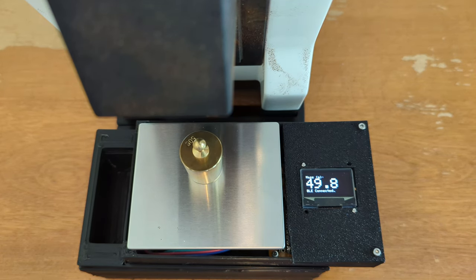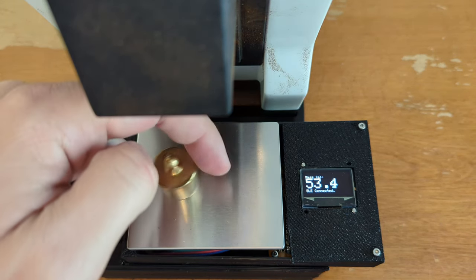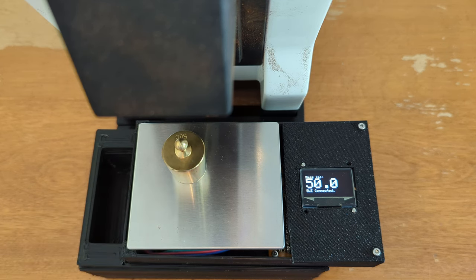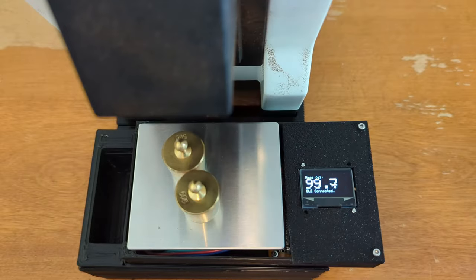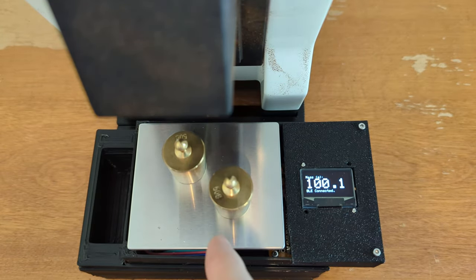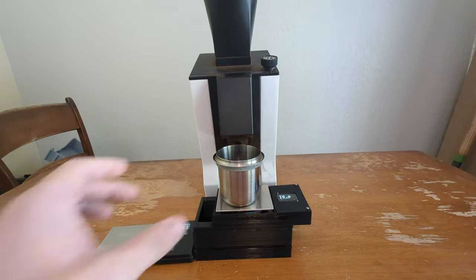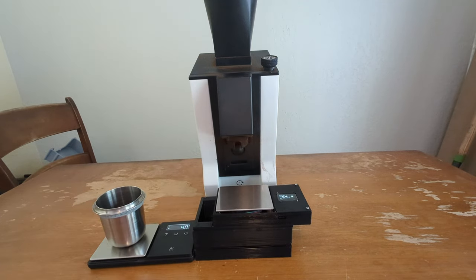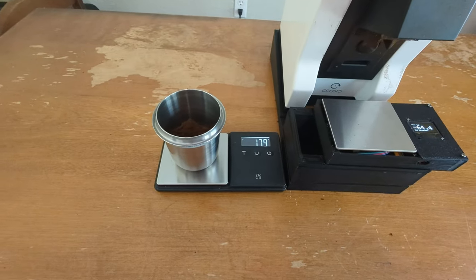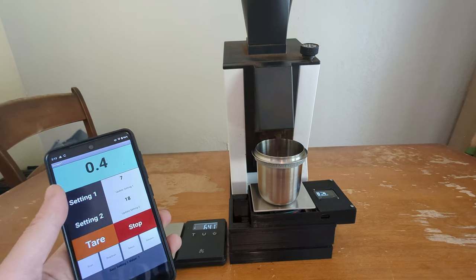Calibration is pretty important, and I've found that my particular load cell seems to be pretty sensitive with respects to where you actually put the weight. If you move the weight around, the reading does change. So I'm not sure if I just don't have it mounted quite securely enough or what, but that's probably throwing things off a little bit. But overall, I can't say that I'm too unhappy, because given that this was my first shot, it's turned out pretty darn good.